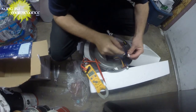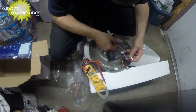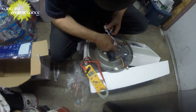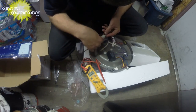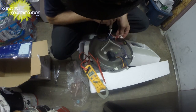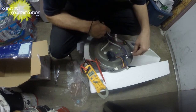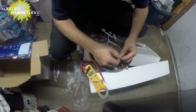One other thing I wanted to check was the negative wire. This is the gray wire, I believe, which is most likely a neutral, similar to the white. Let's see, all the whites and the gray link up, so it's a neutral. So this gray is the neutral, and it's possible that we just lost the neutral.